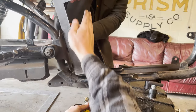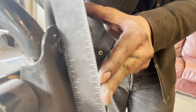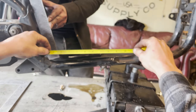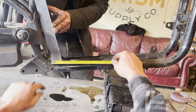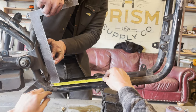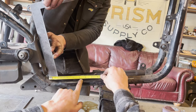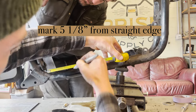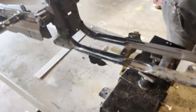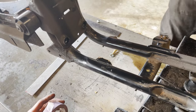So what we're going to do here is hold a straight edge across the transmission mounting points on the boss part — the taller part of these. Then you're going to get a tape measure. It's nice to have a friend here. You're going to hold this side to the intersection point right here, the very edge of this. You want the tape measure to be parallel with this bottom bar and measure out five and an eighth. We're going to get a piece of tape running around both bottom tubes and use that as a guide for when we cut.